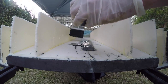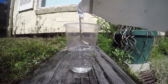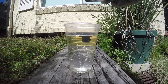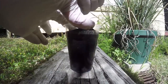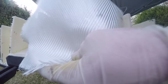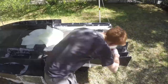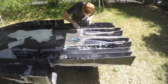The process of fiberglassing something like this is not very easy. First you cut the fiberglass into the sections required, then mix a batch of epoxy — it comes in two parts, the base and the hardener. I added a black pigment for the undertray to get the color I wanted, which was much easier than painting it. Once a batch was made I had about 45 minutes to work with it before it would start to go hard. Doing intricate pieces like the strakes on the bottom used pretty much all of that time. I'd have to fit my hand between each strake and get the brush against the surface, and it was very easy to catch a strand of fiberglass and pull it away. Slowly though the bottom surface was coated and eventually I finished the main undertray composite part.